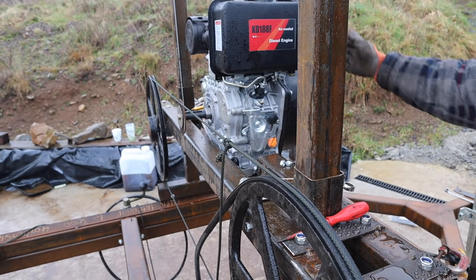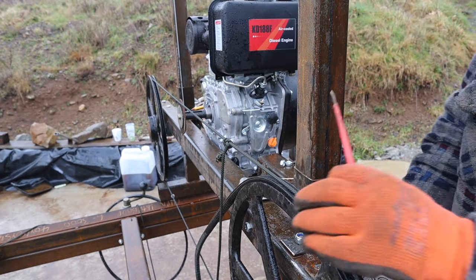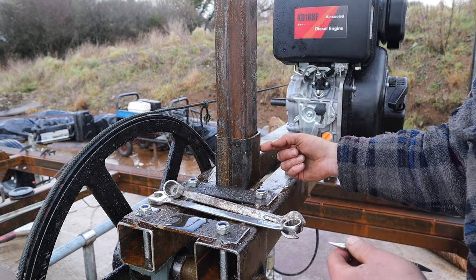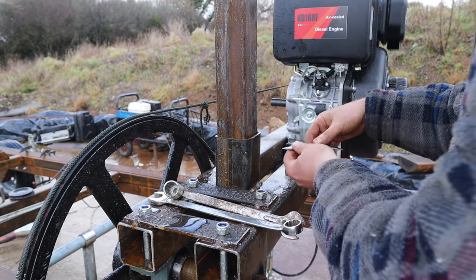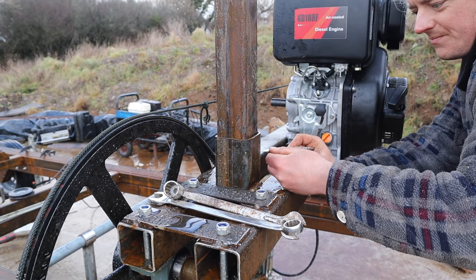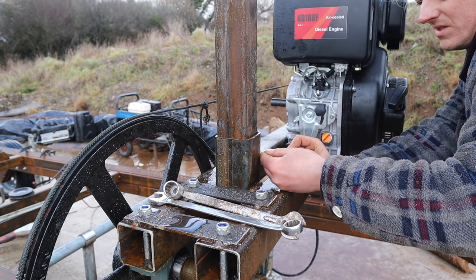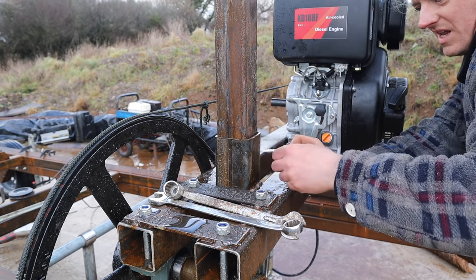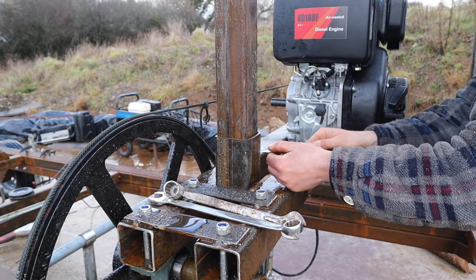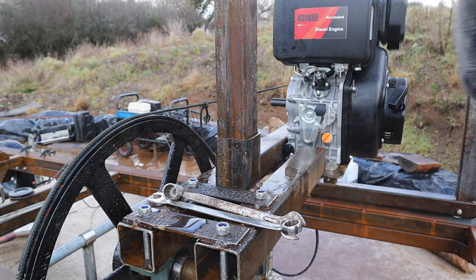Right, motor's fitted, but it's sitting back a little bit, and that is because of the play in these. I'm going to fit some bolts in here to adjust this slack, so into these corners, and then we can adjust them, and they'll run just along the edge, and that will be a better system than just counting on this slack here. If I'd got a slightly thicker walled steel, it might be alright, but it's quite nice to have these anyway, because you have control.